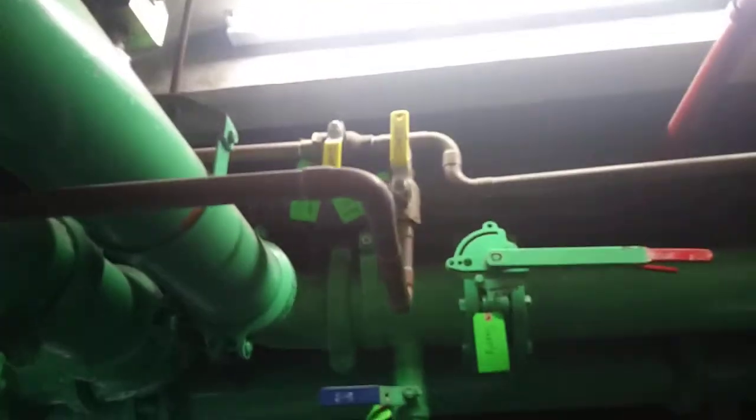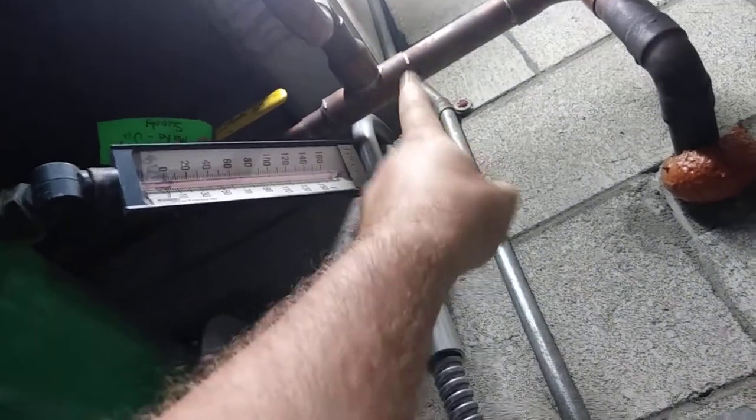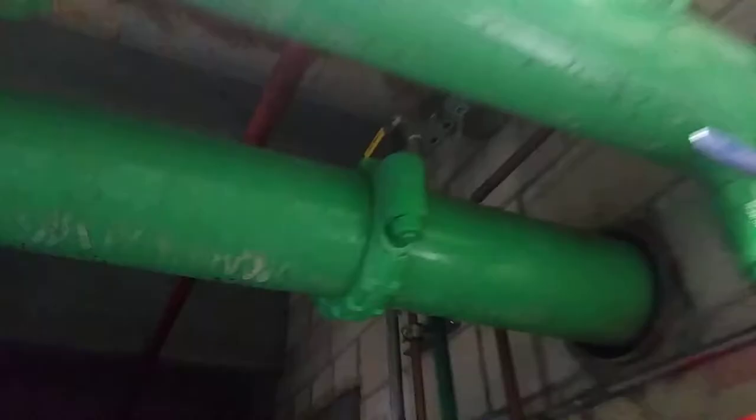Anyway, I just wanted to show you that plumbing work I did — it's been a couple of years and it's all still holding strong. One slightly interesting note: this is an inch-and-a-quarter tee, and that is an inch-and-a-half by one-inch reducer coupling — meant to go over inch-and-a-half pipe. It just so happened that this brand of inch-and-a-quarter tee fit just like a piece of pipe over that, so I sanded the outside of the tee and soldered it up. A little unconventional but it works.